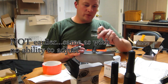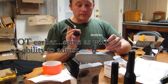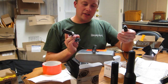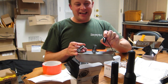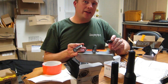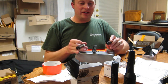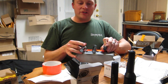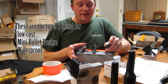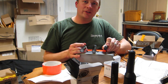We've got an earlier X-View chip, a Sony Super HAD, and a really new Sony X-View chip. The size differences are mainly because two of them have a built-in OSD — on-screen display — for making adjustments. This video will get specific about these cameras to help you make better choices when dialing in your own setup.